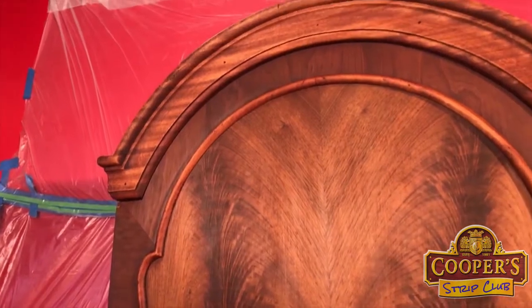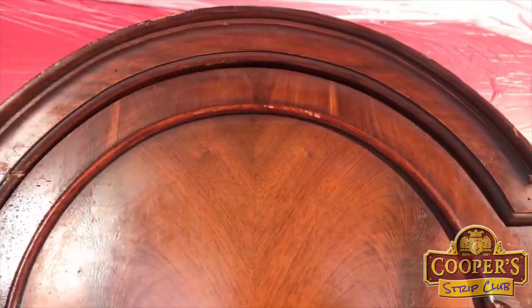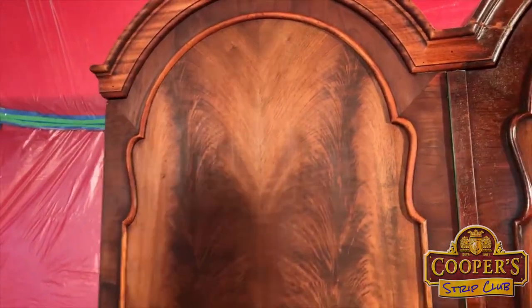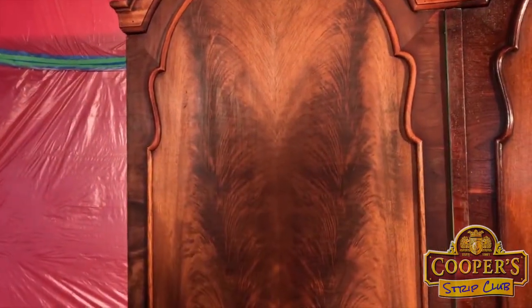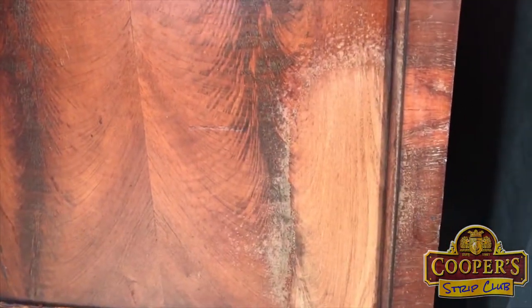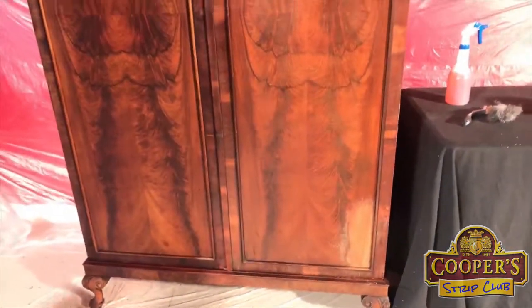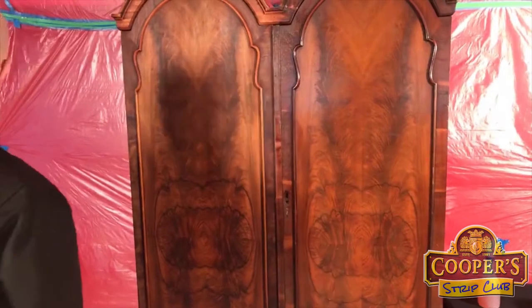So what I'm going to do now is show you a wood finish, but that's now stripped. Never look at the dry colour. So when this all dries off, it's still got flusher in the grain, but if you look down the bottom right corner where it's dried off from earlier, it's got a very, very dry colour, and that's not what it's going to look like with a finish. As I said, it'll look like it is when it's wet with the flusher. Now, let's see if I've got everything over there.